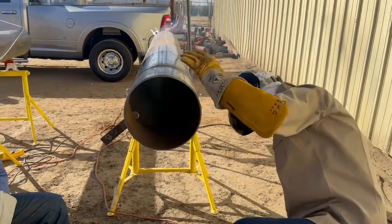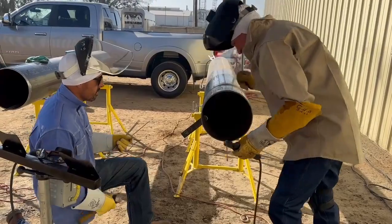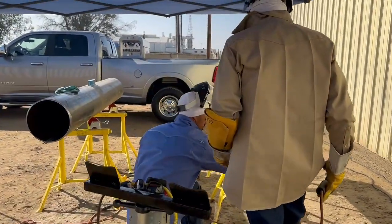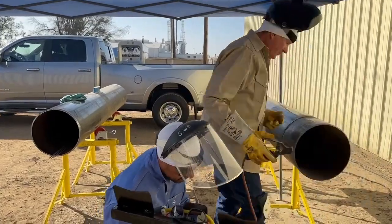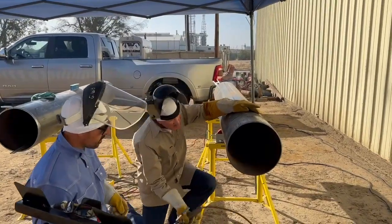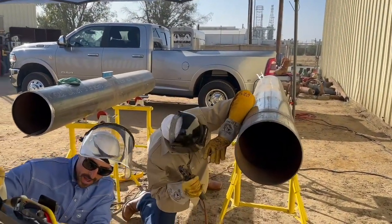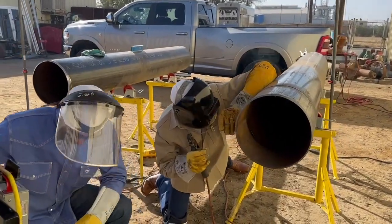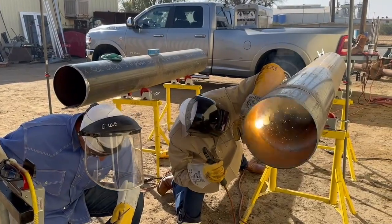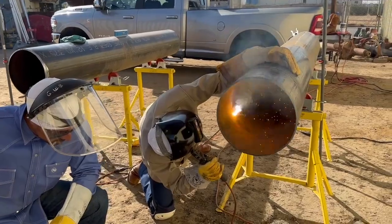The fastest way to weld is to start off at the top where my hand is — start kind of medium, get going, and when you can tell you're okay, kick the heat up. As you come down that side, kick the heat up more and more. Your fastest straightaway to weld pipe is on the side, vertically. If you put an imaginary box around that pipe, you're going to have flat welding, vertical welding, and overhead. As you get off that top and come down the side, that metal is going to follow you and gravity is going to help you.